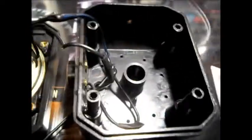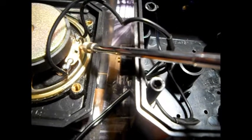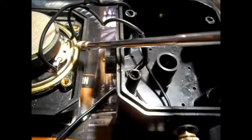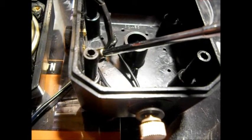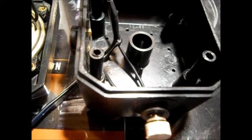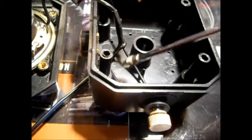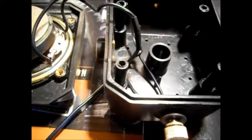This uses a white stripe for the positive. Always check with your own meter on the end of your cord to find out which is positive. Then make sure your speaker is marked — I should put a red magic marker on there to mark positive, but it does have the little plus sign. Your positive comes in, goes to the center of the switch — that's how I do it. Go to the center of the switch, come out whatever side you're going to use, whatever direction you want the knob to work. Your ground just goes straight through.